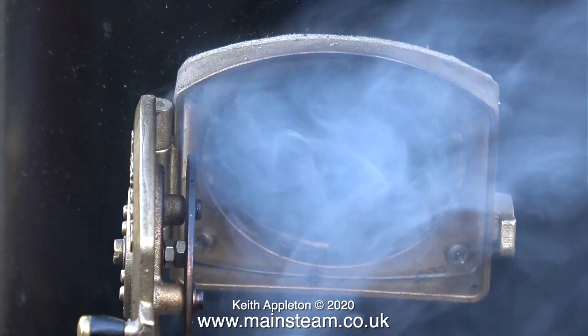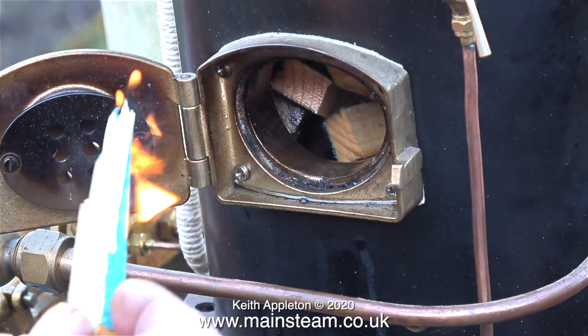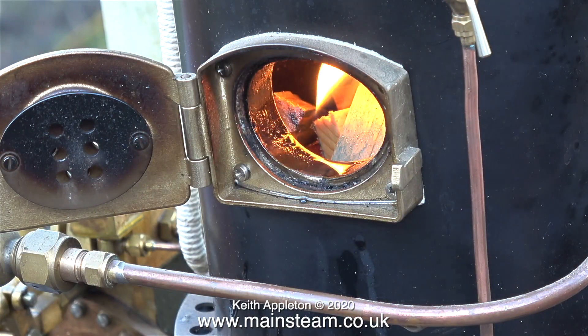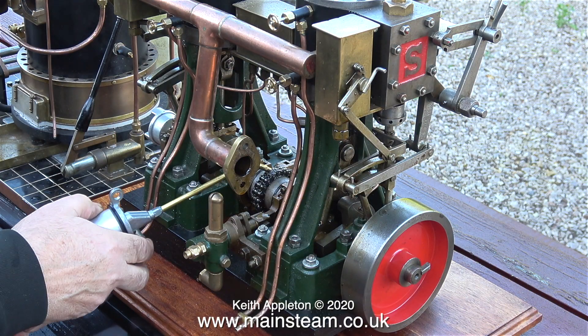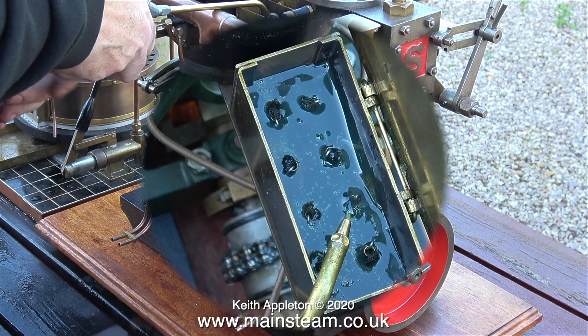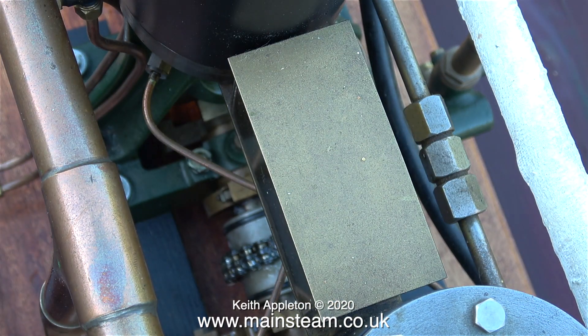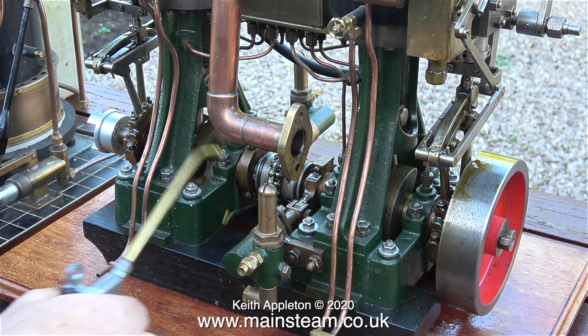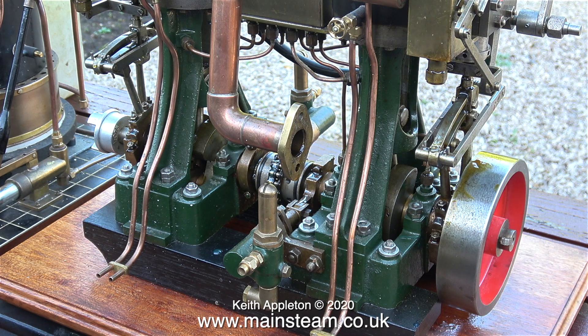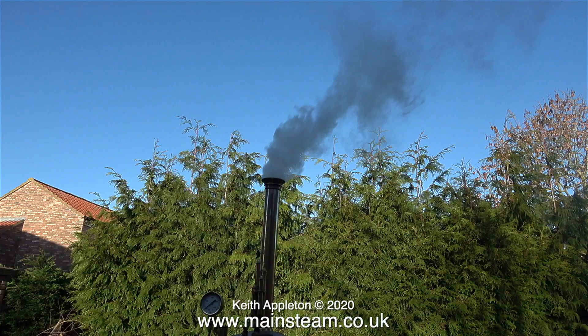I decided it would be more sensible to use some softwood, because this soaks up the white spirit much better and also seems to catch light more quickly. It's best to leave the fire hole door open initially until all of the wood is thoroughly alight, and when that is the case, close the fire hole door. While steam is being raised, I'm oiling the engine. This has a central tank that lubricates the bearings — for this I'm using lubricating oil, not steam oil. The cylinder lubricator tanks are at each end of the cylinder and these are the ones that need to be filled with steam cylinder oil. The breeze and lack of draft is definitely causing me problems today — there's far too much smoke coming out of the chimney.